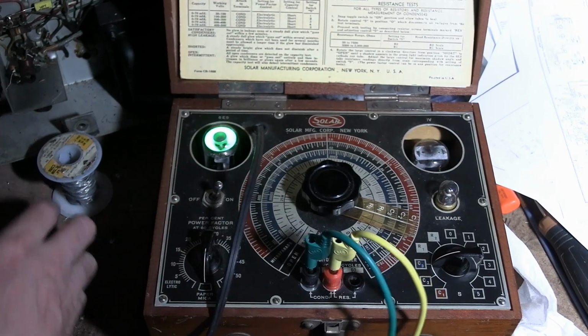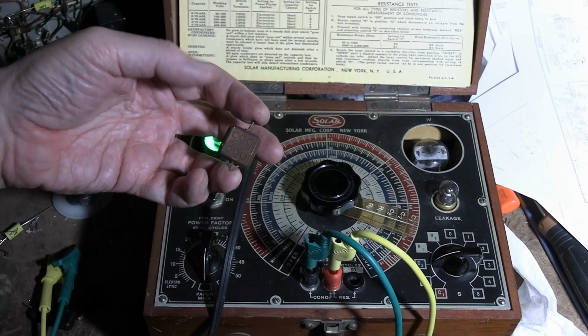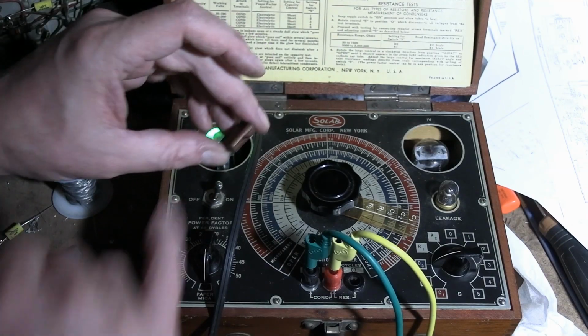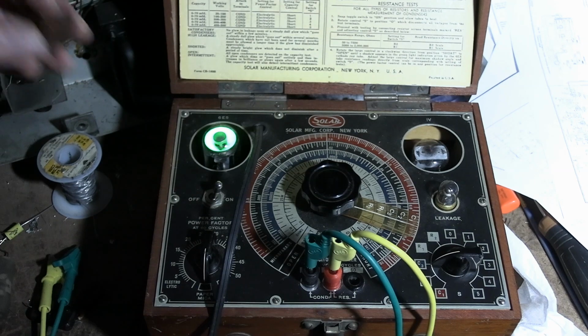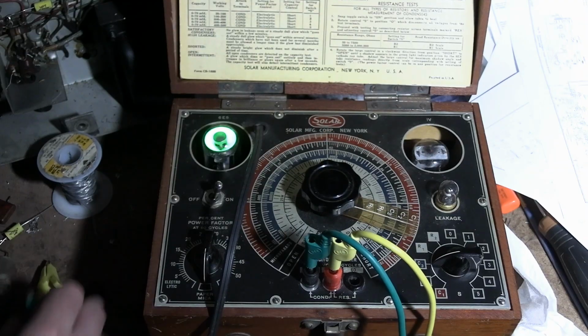But the other thing about these is the leads on these are super heavy, and to unsolder them to test it, you risk fracturing the seal along here. You're even just twisting them so you can read the dots. So it's kind of a pain to deal with. But yeah, okay, I'll replace that with a mica cap. All right, learned something there.